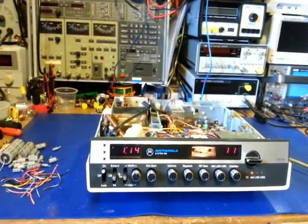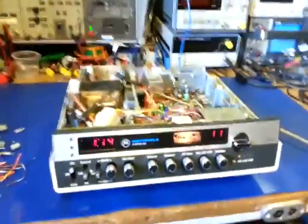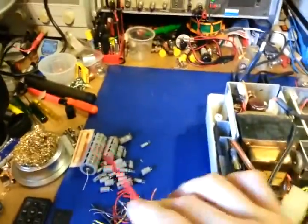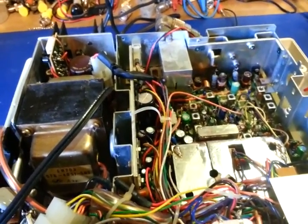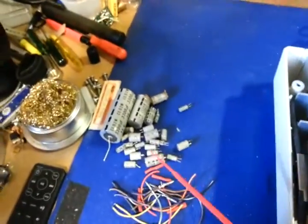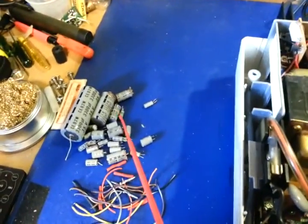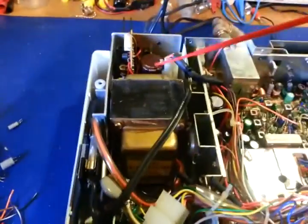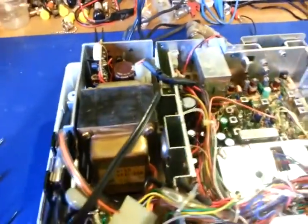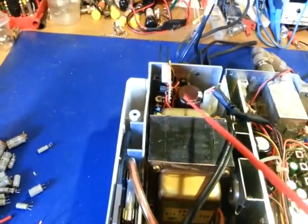The Motorola CB555 is now back together. All of the electrolytic aluminum capacitors have been replaced. Pretty much everything from here over has been increased in voltage value — most were 25, 16, or 10 volt, so all of these are now 50 volt. The power supply cap was also upgraded. I only use good quality capacitors — that's a Nippon Chemicon, upgraded from 3300 to 10,000 microfarad.